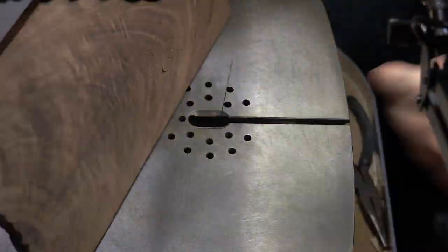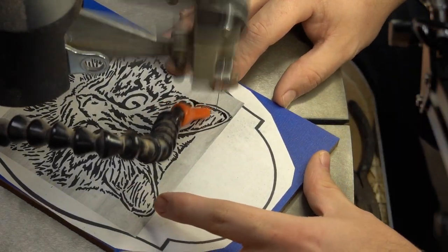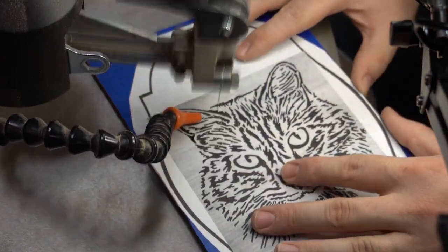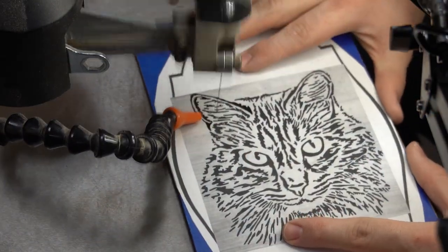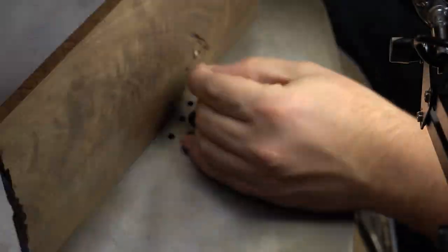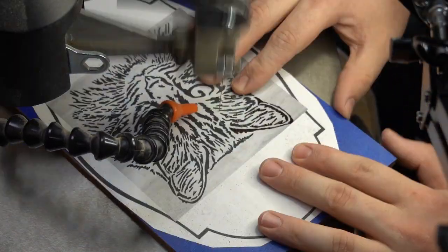This project was made as a gift for a co-worker. It's a pattern by Russ Beard, and I used quarter-inch highly figured walnut that I got from Rockler. Rockler had some figured walnut short pieces, and I planed them down at a friend's shop because my planer only has straight knives. His planer has the helical cutter head, and it left a good finish on the figured wood without tearing it up.